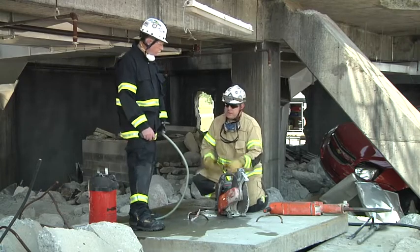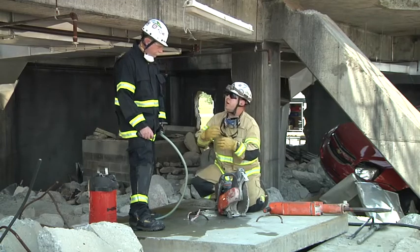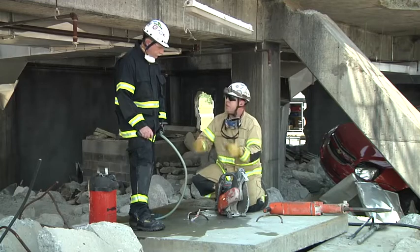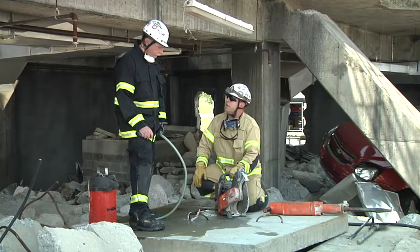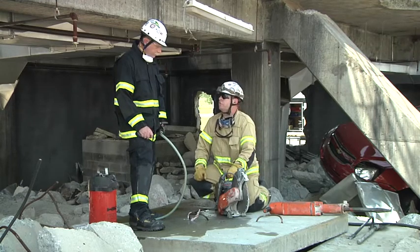Yes, sir. We're still able to move because you're going to spray a little bit of water, just enough to continue to make chocolate milk on my wheel. As long as we're making good slurry, or that chocolate milk, we're still going to be cutting concrete. So we don't have to actually have it coming through the machine. We can spray it on externally.